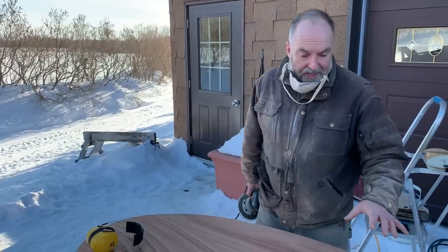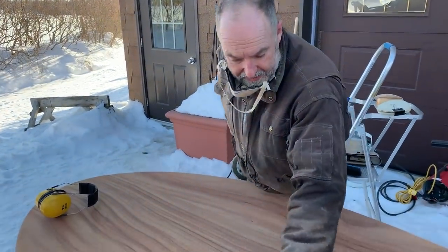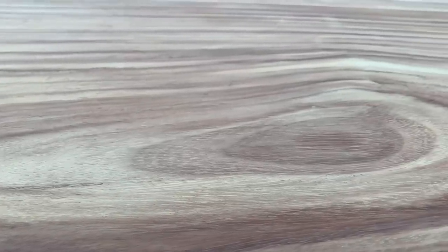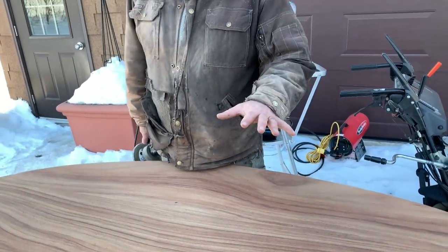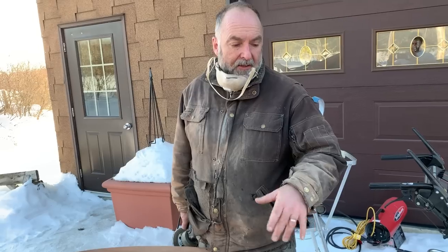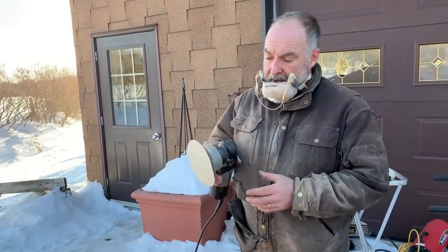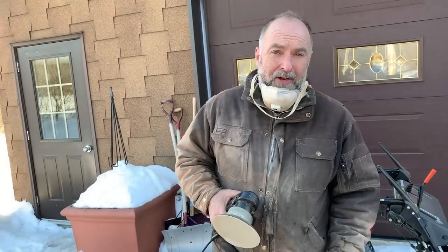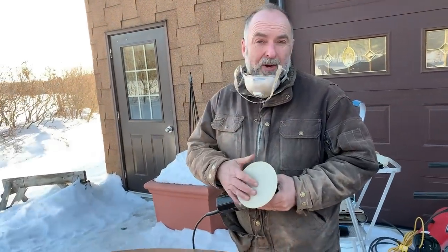I've finished sanding with the 80-grit belt and I'm quite pleased — those little vandalisms that someone in our house did are gone. The deepest one was here and it's going to pretty well disappear, and all that other stuff is fixed. I did that with the 80-grit belt parallel to the grain, then switched to a 120-grit belt to bring the finish up a little finer. My next step is 180-grit sandpaper in a finishing sander. I've been using the random orbit sander along the edge to remove the finish — first with an 80-grit disc, now a 120.